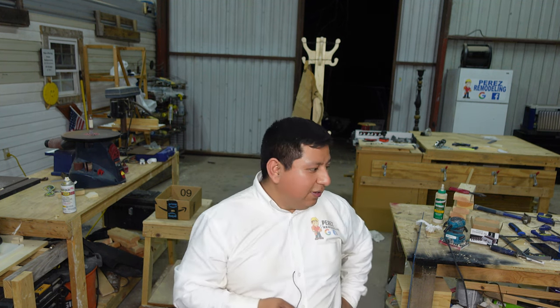That thing looks amazing. All the dowels are in place. Everything is tight together. I used some tying wire to keep that, just because it's going to be very awkward to use clamps. I'm gonna let that cure overnight, and tomorrow I'm just going to touch it up, clean it up some more, and then prime it and paint it and ready for pickup.